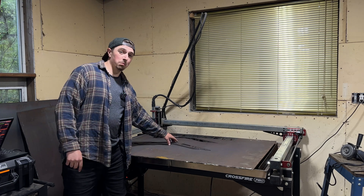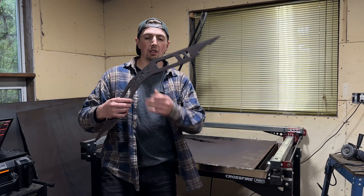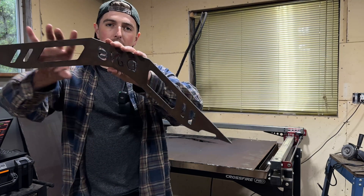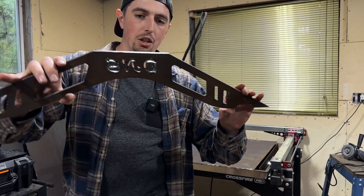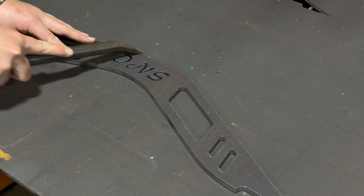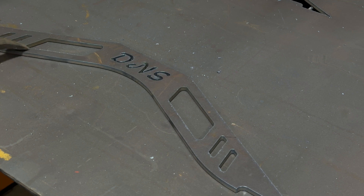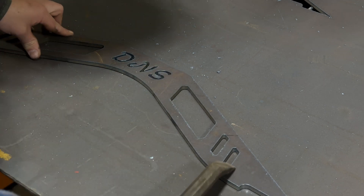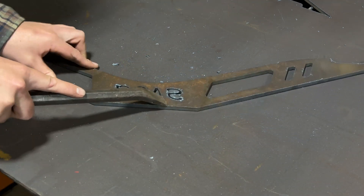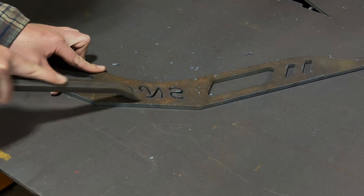This machine is just proving more and more useful. This is coming straight off the cut — no post-processing whatsoever. Look at the cleanliness of these cuts. There's a little bit of slag on the back, a little bit of cleanup to do, but this stuff just chips right off. This machine has just saved us so much time. When you finally dial in the proper settings, get your proper clean air, and find some tips that work well — for us it's the hypertherm tips with the razor weld plasma cutter. It's one of the best tools you can have, especially for this off-road building. Things like trusses and link mounts get so easy when you can take it from concept into reality within a couple hours.